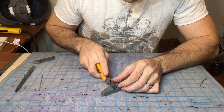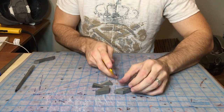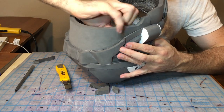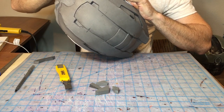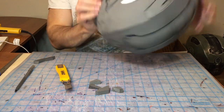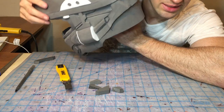One of the easiest ways to do this: put the piece in from behind so it's kind of filling that gap, take a pen and reach down inside there and trace along the interior of that shape — that'll give you a rough idea of how you want it. Pull it out and look at it. So roughly a shape like that little piece there. I'm going to cut it just a little bit bigger than that shape because I want it to kind of wedge in like a little puzzle piece and fill the gap in. Cut about a 32nd of an inch past. If you don't know what a 32nd looks like, grab yourself a graphing ruler — it's got all the cool points and measurements. Put the piece in from the back side — it's easier that way. You've got to squish it in there. You can get this cool little step down inside there.